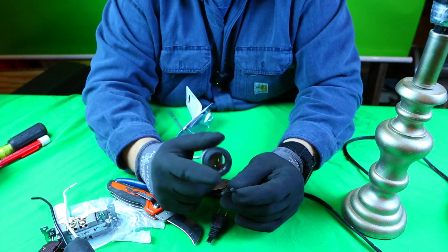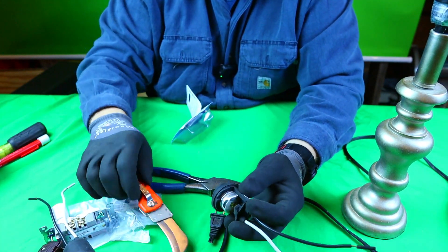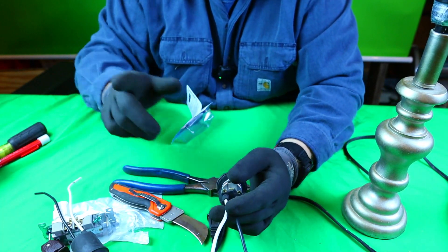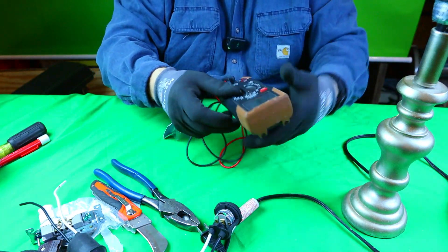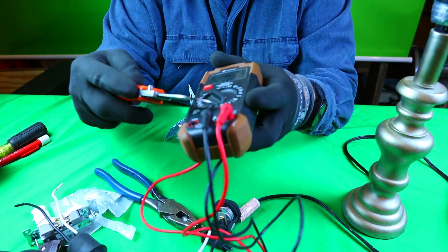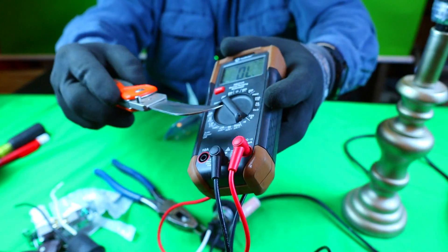Remember what I told you: the rib always goes to the neutral. So we know that the neutral is all of this aluminum colored shell right here. Same goes for this. We can always ohm it out, and I'm going to show you how to do that. We're going to get this meter right here and we're going to put it on continuity. I like the one that beeps. It's this symbol right here — it looks like a bunch of sound waves.